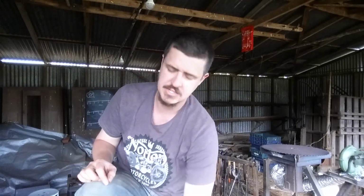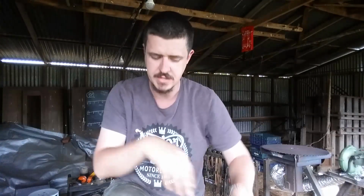There's 3 hits to set the weld, because it's a long billet, so I do one in the center at the back, and then in the middle, and then at the front, to try and push things out towards the edges, push any impurities out. The first hit sends a shower of sparks. It's pretty much the same as what Adam and I saw with our eyes. The second hit, however, produces not just a much larger shower of sparks, but it actually shoots a giant gob of dross off.